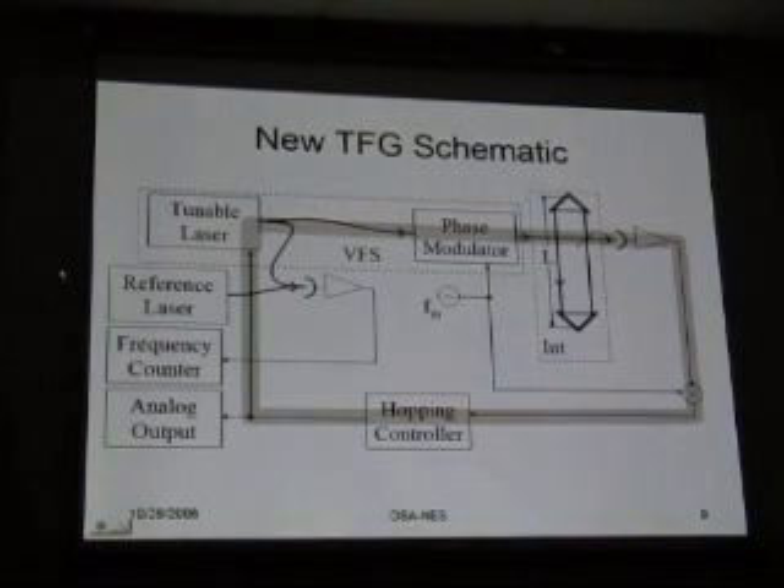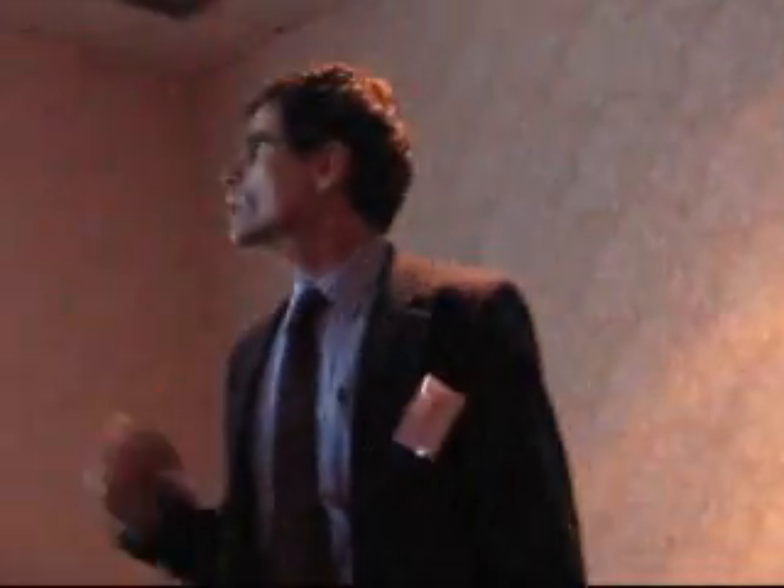That's what we need for this work. We've used that to detect vibration of the test masses, which caused transitory liftoff of two types. One: the test mass would hop up and down, executing a parabola of a few microns amplitude in a millisecond duration. Other times, lateral vibration would cause just one test mass foot of the three to lift off — a slower parabola, maybe a micron amplitude in a few milliseconds duration. Looking at the accelerations, I was able to reconstruct those two kinds of behavior. All of that was coming through the old laser with the one-fringe range, and this new one we expect will do a lot better.